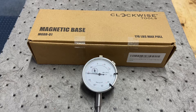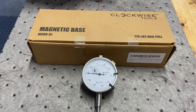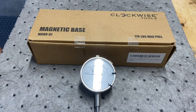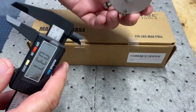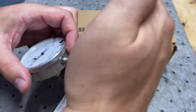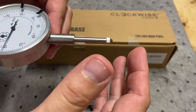In one of the previous videos, I had gotten a magnetic base holder. When I opened it, these are the types of things that maybe these videos will help - I don't know this stuff, I don't know to check for this or the other. It really comes down to what fits what. This right here is where you mount up to magnetic base holders. The first question was how do you mount this thing? There are all kinds of attachments. You can get some magnetic bases that will screw through here and hold it flush. One of those might be nice to check for parts as you're moving your compound across a piece, so you can see what your runout is.